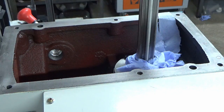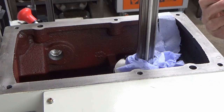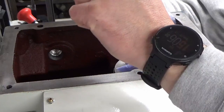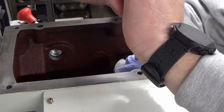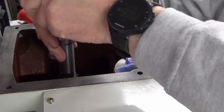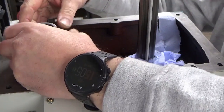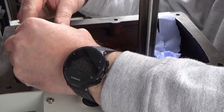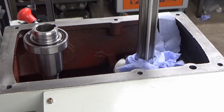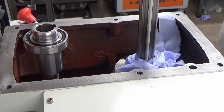So what I'm going to do, I'll just get some oil. Everything's clean in there. As you saw previously, that head's been completely cleaned out inside. So I've just got a tiny bit of oil, and I'm just going to make sure everything's really well lubricated for the final fit. So this is where I am going to be putting stress on the bearings, because I'm going to be driving the shaft down, but actually into the outer race is what I'm trying to fit on that bearing. But these are quite slack, I think, from taking them apart. So I'll just get a hide hammer or soft hammer,